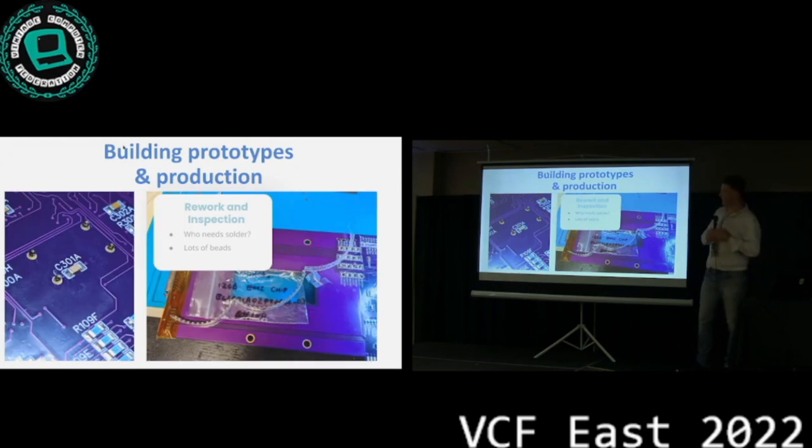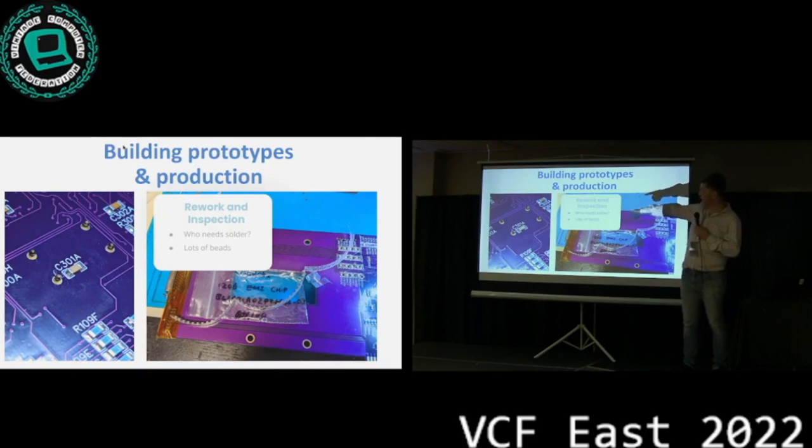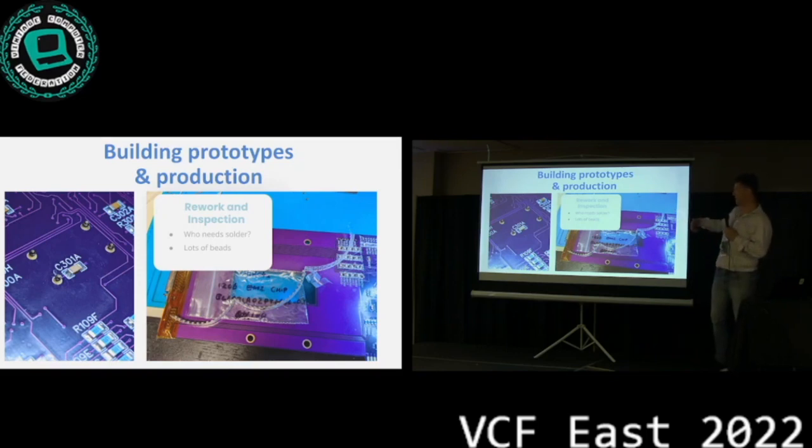And then some fun pictures here, actually. When I put the quartz in, typically I would put little pin headers through the holes and then put the quartz in, so I could ultrasonically clean the boards and take the oscillator out. On this board, I had completely forgotten, for some reason, to solder the 4 pins in. And because the fit was so tight on the first revision of the boards, the card just worked fine. And we found it later when we were like, wait a second, this still looks very golden and not as silvery as we anticipated when we were inspecting the boards.